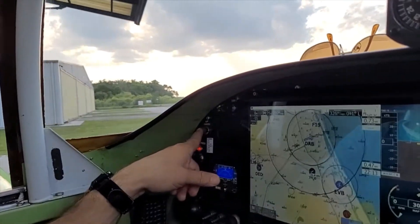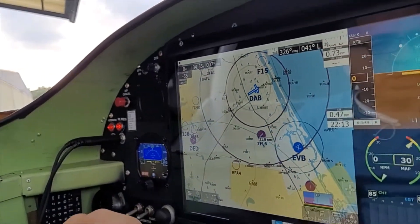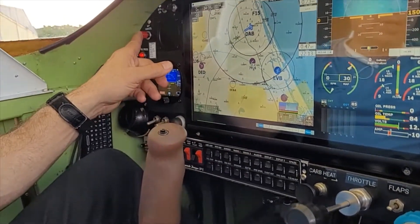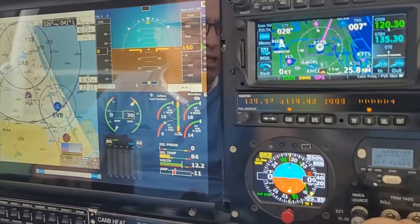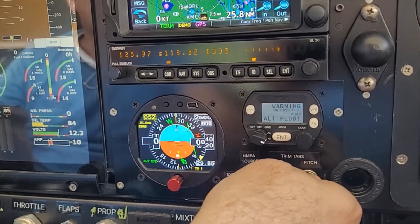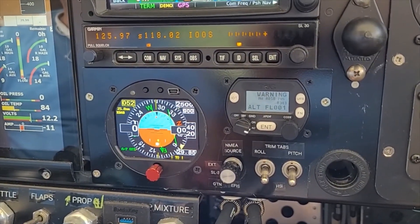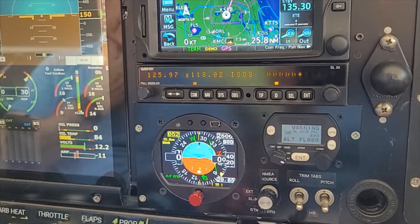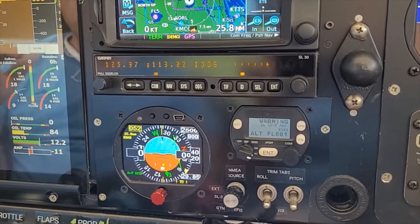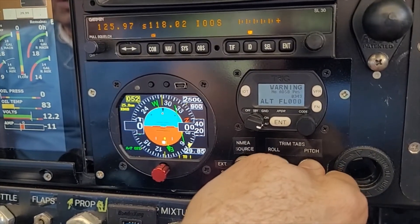The autopilot has two switches you need to install. One is the autopilot disengage switch — normally placed in the yoke — which is a push button you press to disengage the autopilot. The other switch disconnects the five volts to the servo, allowing you to disconnect the servos in case of a runaway so you can still control your plane. Once you disconnect the servo, the trim tends to become neutral and you can fly normally. It is very important to have both your servo disconnect switch and disengage switch.